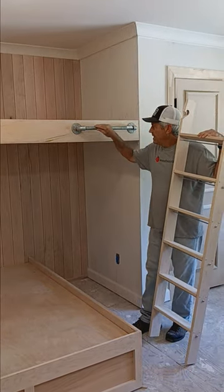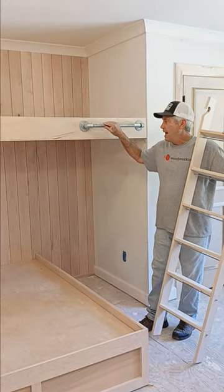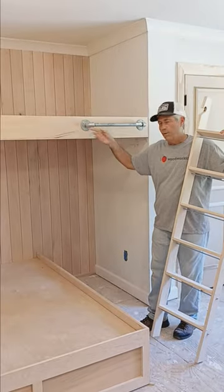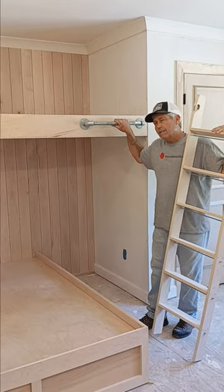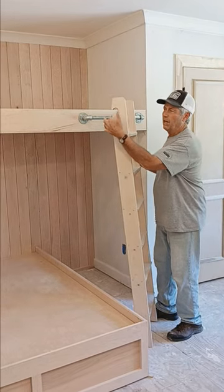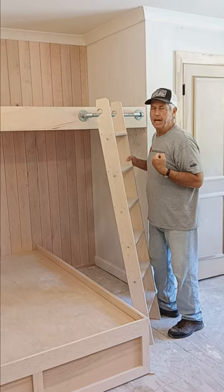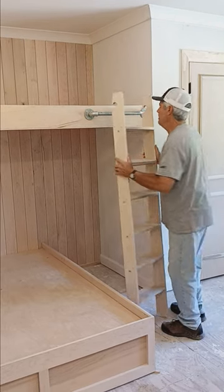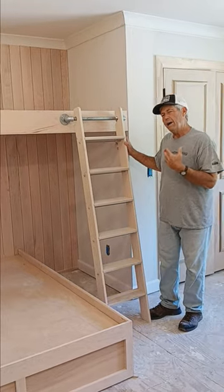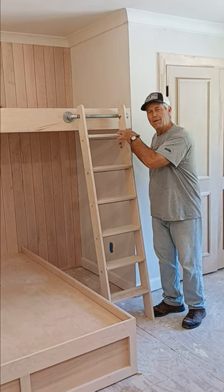The place we attach to the bed is simply a piece of three quarter inch galvanized pipe with a couple of floor flanges, a short nipple, and an elbow — and I feel like that gives us plenty of strength. There's still lots of maple left here where we made these notches, and enough return where it's just not going to come off. This simply just drops on there, goes down to the floor, and we've got a really strong, safe ladder for our bunk bed project.